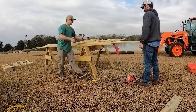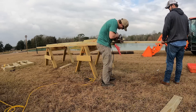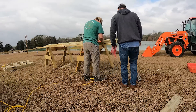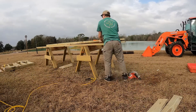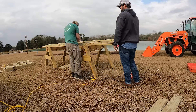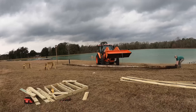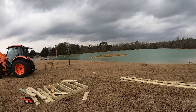You can see me finish cutting the decking boards — there ended up being about eight total with a two-inch gap. We went with a two-inch gap because we didn't want it so tight that rain couldn't get through, but we also didn't want such a large gap that when the bald eagles come up there and eat, they'd drop their food through.